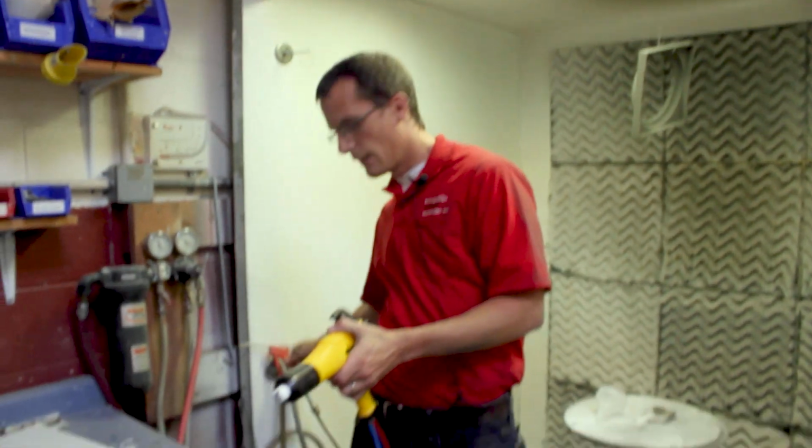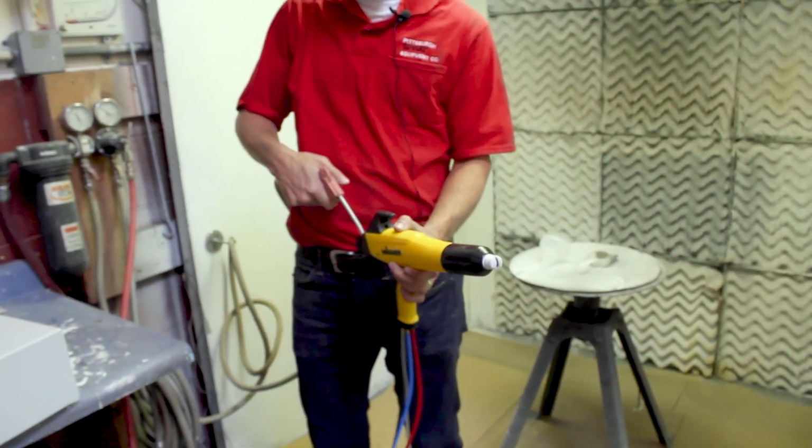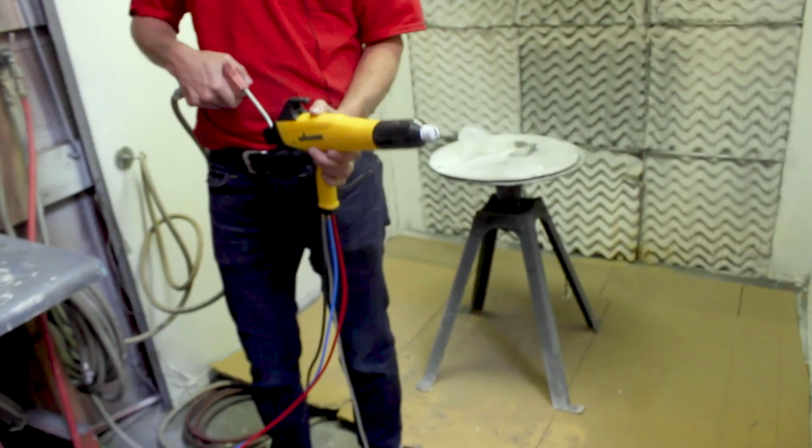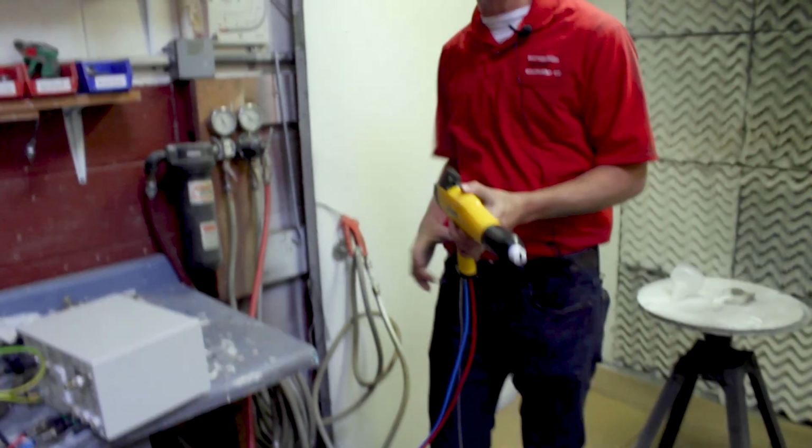for the powder feed, and you can even take a small earplug and blow that through the line so that any residual is removed. With this little cup gun, you can just do this until you notice that there's no more air with powder coming out of it.